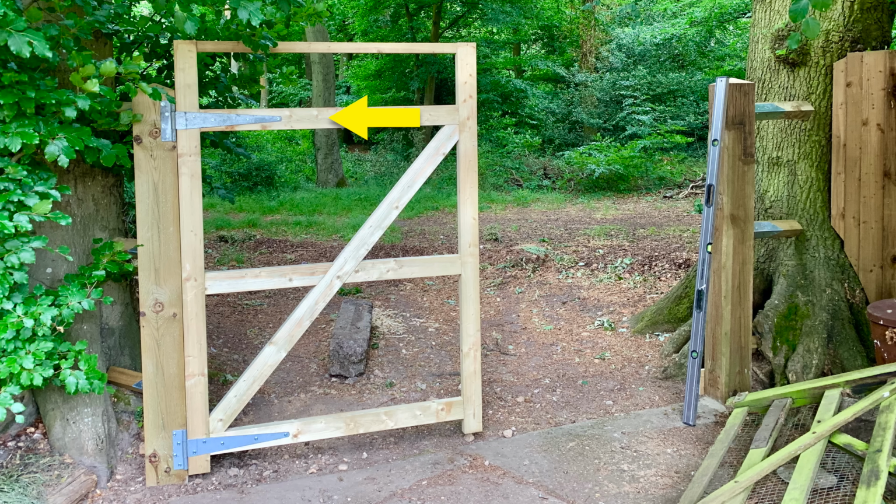Because I learnt from the issue with the other gate, and that my posts are only 1.8 metres high, the top hinge rail is lower down. Because I'll be attaching a capping rail to the top, I need something to secure it to, so I used a counter rail here, which I'll be adding to the rest of the fence in the next video.